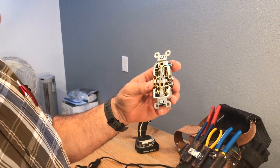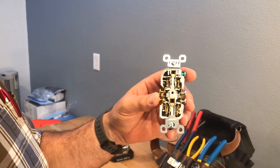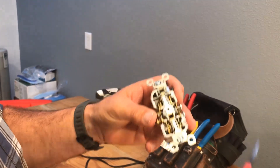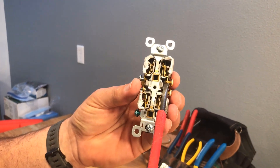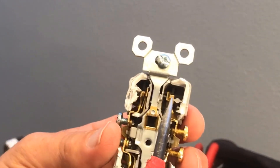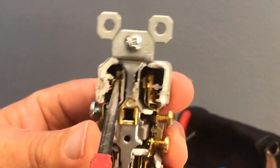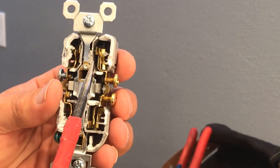I really want to emphasize how little metal is actually involved and how easy these can wear out. Here are your terminals where the neutral and hot wires are attached. You'll see there's solid metal — it's just threaded, it's not very thick — and you have two pieces of metal under tension. It's just a spring connection.